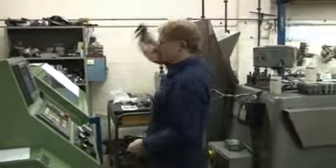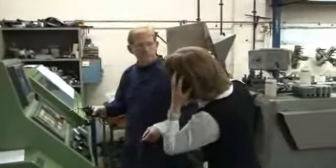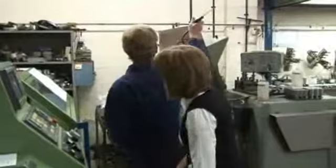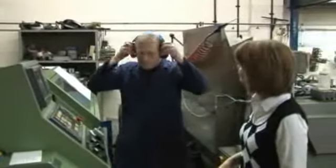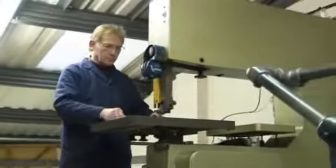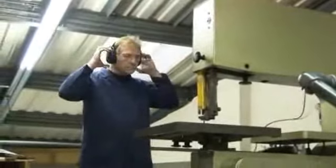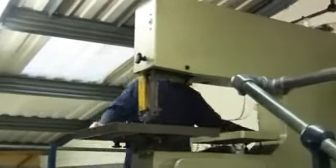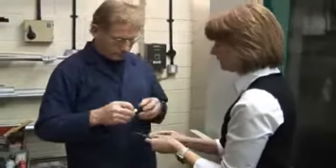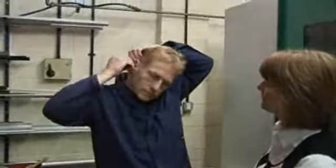And secondly, wear rates. If hearing protection was not worn for 1 hour during an 8-hour shift, the maximum protection that can be achieved is 9 decibels, irrespective of the performance of the protector. There are many different types of hearing protection, but by far the most important requirement for protectors is comfort rather than absolute performance. In reality, comfort usually means choice, as personal preferences differ.